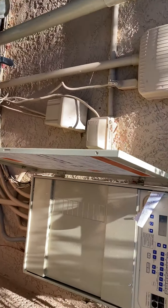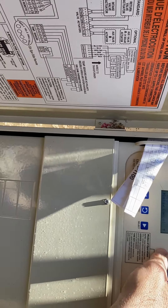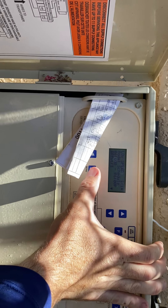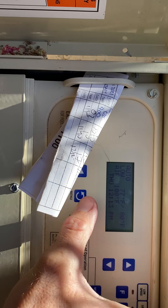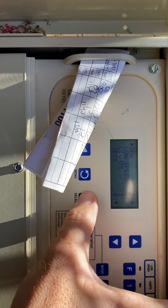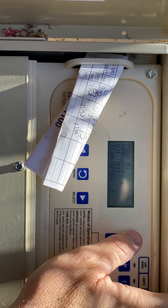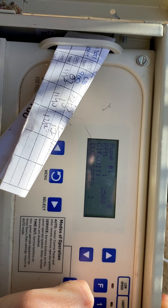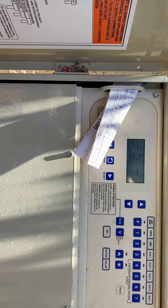It's also important that you never change your low speed timers. You have Screen Logic — you want to make sure that 6am to 6pm is what it says. Your high speed or low speed should never be changed. If it is changed, you're going to have issues. At 2500 RPM, basically what's going to happen is your spa will overfill if that goes any higher than that. And that's it.